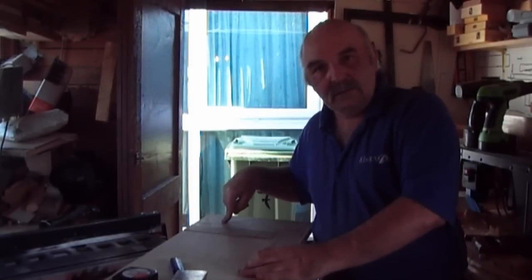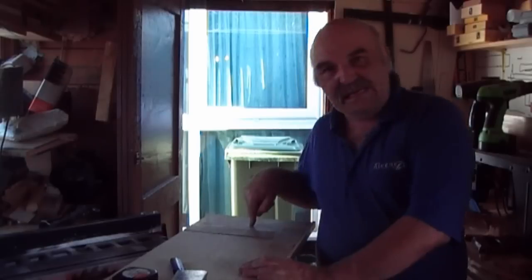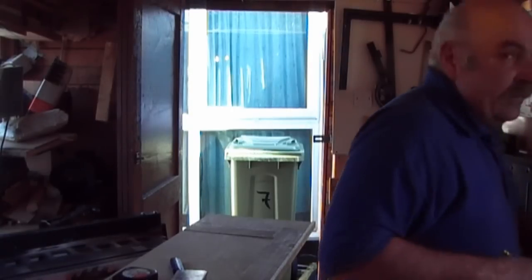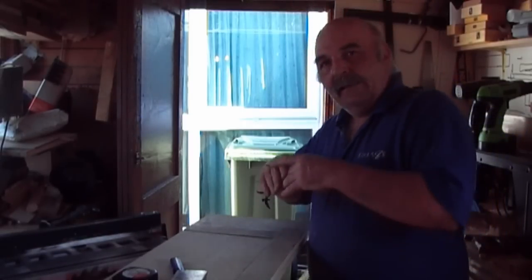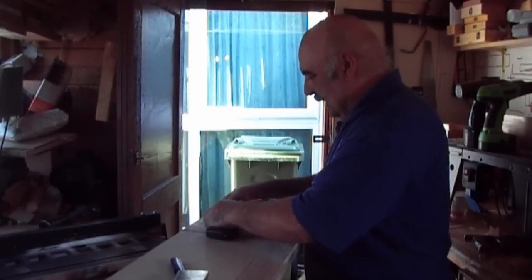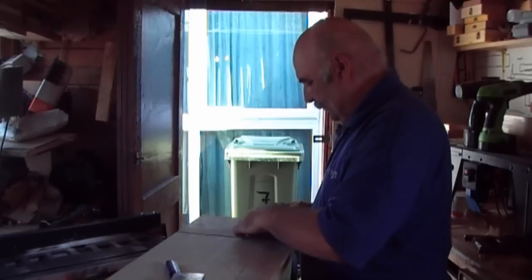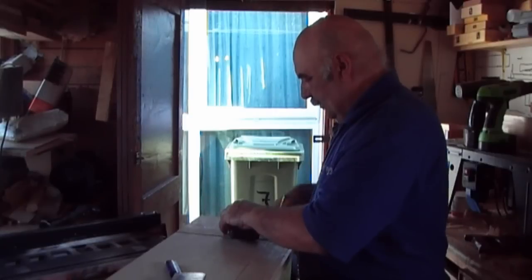Now, I know what the inside is which is marked here. Now I've got to mark 12mm from that line. I've marked 6 just for the tongue, but that's how the original was, and I want to make sure I make it the right size. So I've marked it out as the original and then put over extra. So now we need 12mm here instead of 6. So I need to mark that off there. Right, 12mm from there.